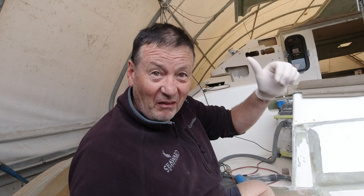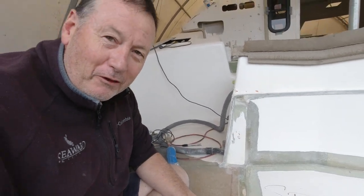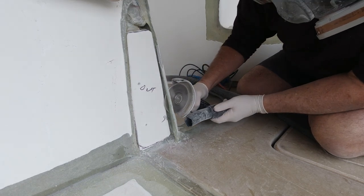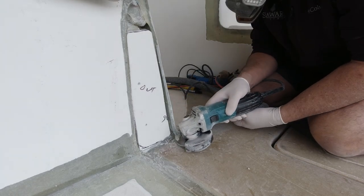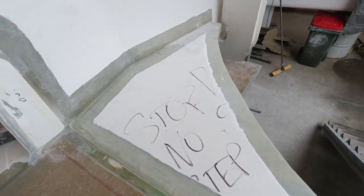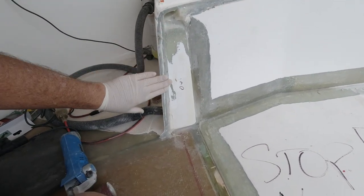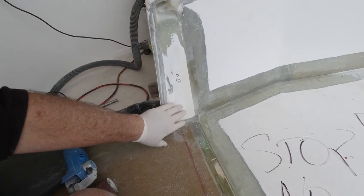It's the 15th of November and it's freezing - it's like snowing 100km inland, unbelievable. It's almost bloody summer for god's sake. The other day I put in an infill of an offcut of solid glass which is now glued to the bulkhead and to the transom step-through transom of the boat. I've also glued in what I'm going to call my winglets on the back of the boat - these little infills. Now I'm going to integrate all this together. I've basically chopped off the back of the boat which is a pretty ugly bump there, but this is going to get all sanded back.